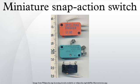This over-center action produces a very distinctive clicking sound and a very crisp feel. In the actuated position, the curved spring provides some upward force. If the actuator is released, this will move the flat spring upward. As the flat spring moves, the force from the curved spring increases, resulting in acceleration until the normally closed contacts are hit. Just as in the downward direction, the switch is designed so that the curved spring is strong enough to move the contacts, even if the flat spring must flex, because the actuator does not move during the changeover.